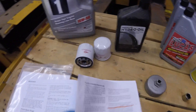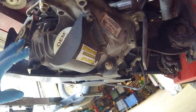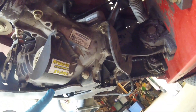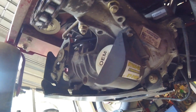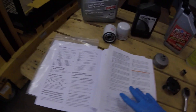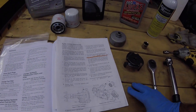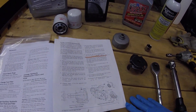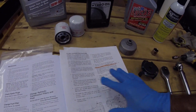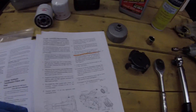These hydrostatic transmissions are an all-in-one unit, meaning the pump and gears are all together. They're made by a company called Hydro-Gear, and this is the model ZT-3100 — a commercial transmission used on mowers, aerators, and similar equipment. I'm going to show you both the Exmark manual and the Hydro-Gear service manual for the ZT-3100 (covering ZT-28, 31, 32, and 3400 — all the same service manual, available on their website). Most of the procedure is the same, but it notes a couple of things that can save you some money.